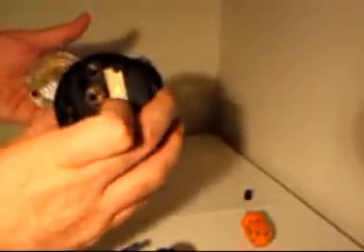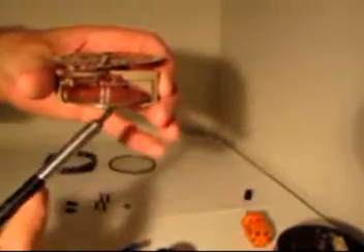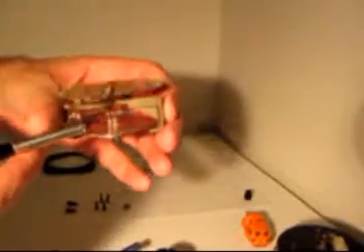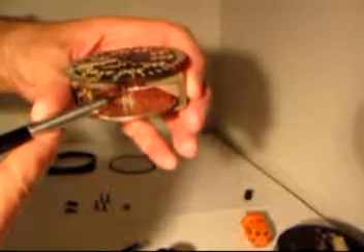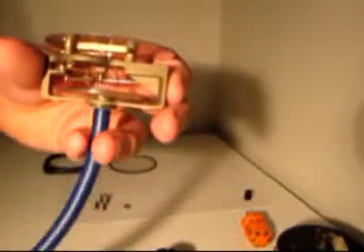The mechanism is held into the case by one little brass nut that fits on there — there's the brass nut. That holds it together through the central brass fitting on the pitot inlet; that's how the mechanism is held in the case. Here we see the copper aneroid capsule that takes the pitot pressure. That capsule expands and through linkages moves the needle — if I just lift that, you can see the needle moves as that copper circular aneroid capsule expands.